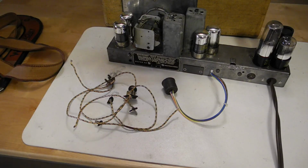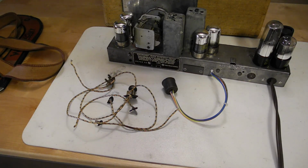The radio as received had a second set of battery wires connected. A previous owner had apparently added wires to allow using separate, high voltage but still available batteries in place of the hard to obtain Zenith battery. I removed them and also replaced the battery wires as they were crumbling.